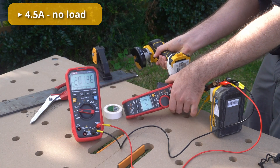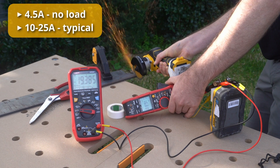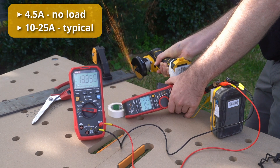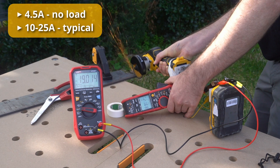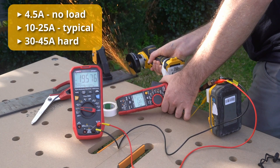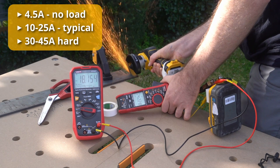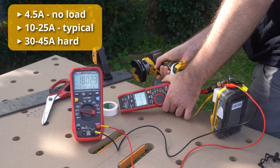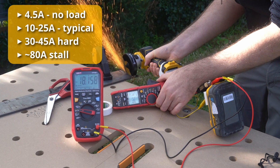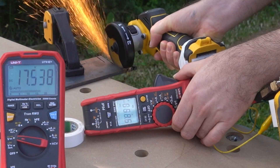Here I'm doing a quick power test to see how much current the tool draws. It's 4.5 amps with no load, and typically more like 10 to 25 amps. Remember the trigger was rated about 25 amps, and we're going to go much higher than that — but I think it's probably fine, as these things can handle much more than their ratings suggest. Taking it well above 40 amps steadily and the tool's not bothered. Pushing as hard as I can, it gets up to 80 amps, and that's when the electronics say that's the limit and cut off.